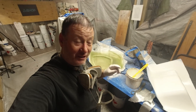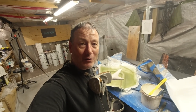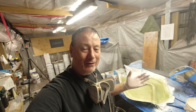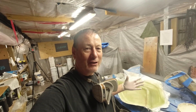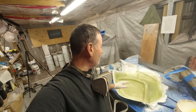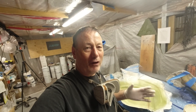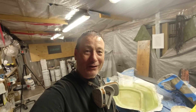About an hour later the gel coat is touch-dry and ready to laminate. That's now four layers: two layers of 300, a mat layer, 600 double bias, and another layer of 300. Tomorrow I'll add foam core under the step and core mat around the riser — a 3M or 3XM core mat giving two millimeter thickness and good strength. The strength of the part will be further reinforced by multiple layers of tabbing around the perimeter once it's integrated into the deck.